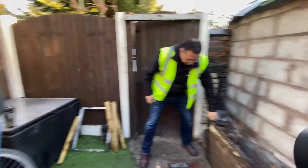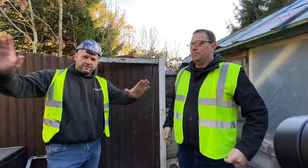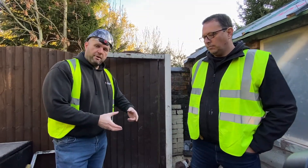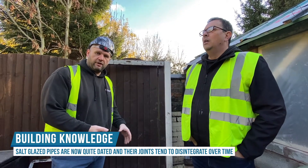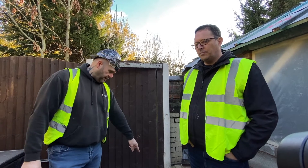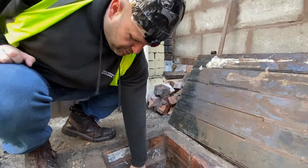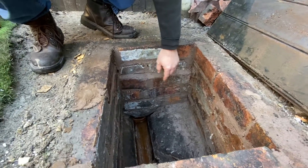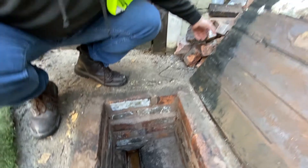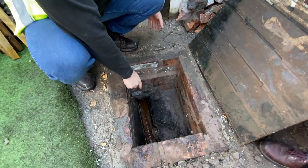What's the reason for the collapse? Old age and a mass of shit. This is an old sort of set of terraced houses. The 110 pipe — which is the size and diameter of the actual pipe — is made out of terracotta clay, or what's called salt glaze. Over time, with all the pressure and stuff, it starts becoming a little bit fickle and brittle. Where it runs down on the gradient, just beneath my finger, where it all goes underneath that brick, it had actually collapsed. So we've come in here, we've had to rebuild this manhole — this is new brickwork. We've brought the plastic pipe in behind here, because inside there we're going to put in the new WC. It's got plastic there, but we've tapped into the salt glaze down here, and we've had to rebuild this.